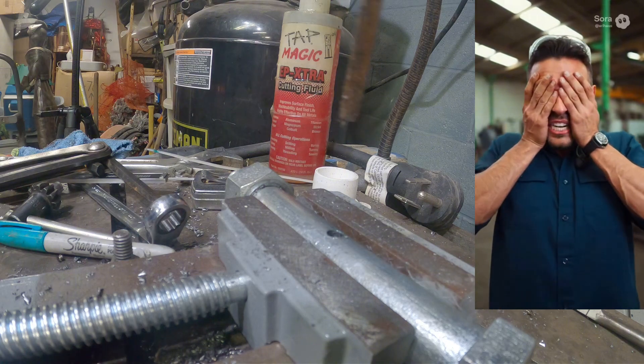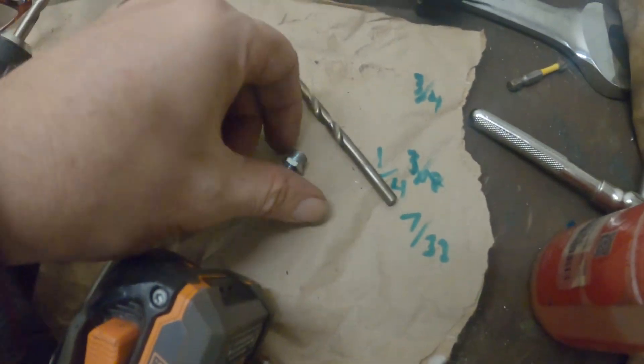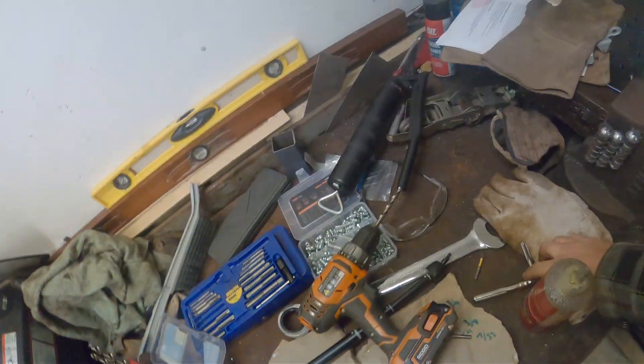I got metal in my eyes. After all that, I made the stupidest of stupid mistakes — I had the 10-millimeter one right next to the 9-millimeter one. I couldn't figure out why my hole wasn't big enough, so I went up a size, just far enough for the threads, only to realize it was the wrong one. So that leaves me using the 10-millimeter with the 1.25 thread pitch, and we're going to very gingerly get this in and maybe use a little lubricant. Even though the threads are not going to be quite right, we're just trying to get it in there so we can push some grease. So let's see if this works out — otherwise I botched the whole thing, which would be fantastic.